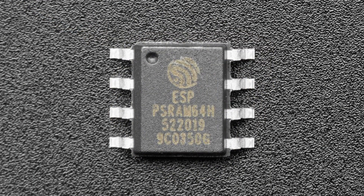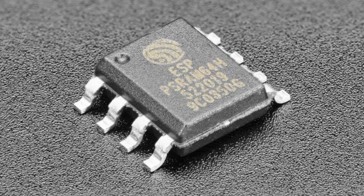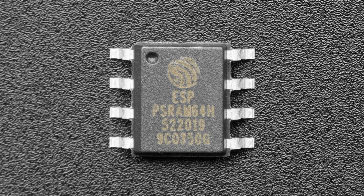Next up, we've got some PSRAM. This pseudo-SRAM is 64 megabits — that's eight megabytes. Very useful if you are building an ESP32-based project and want external PSRAM, more RAM that will be automatically memory-mapped. Also, the Teensy 4.1 has a spot on the bottom where you can solder this chip in and address it as pseudo-RAM. It's slower because it's using QSPI instead of being on-die, but for a couple of bucks, if you need a project with eight megabytes of RAM, this is really the only way to do in-place memory-mapped SRAM.